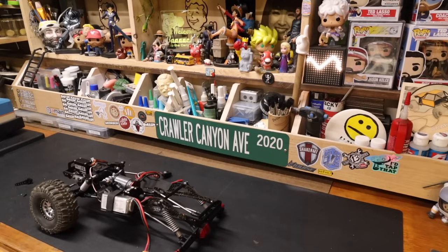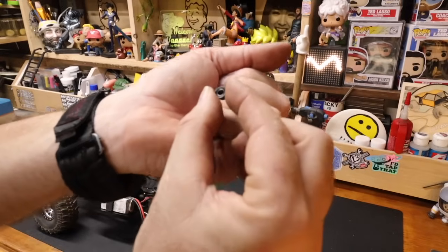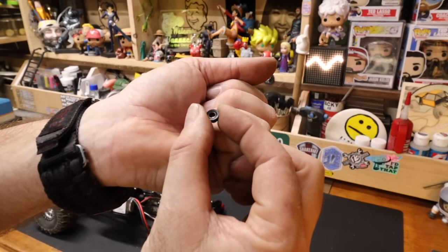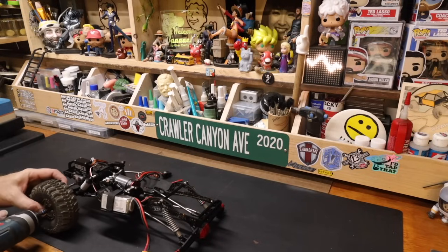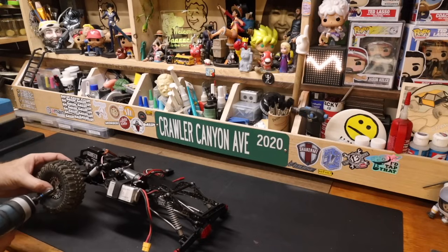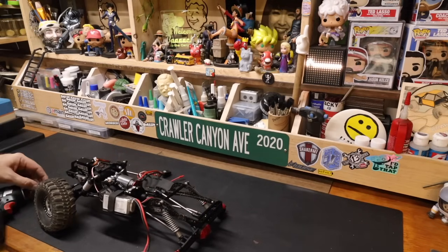What I probably don't have in the box are wheel nuts. I do not, because they do non-flanged. My recommendation to one and all is don't do non-flanged. Also, if you can, and this is great because I have it in the box to show it. Do you see how the back of that is smooth? What you want is that. Focus on the serrations, please. You want the serrated, because it will give you that last line of defense after you've reused your wheel lock nuts too many times. So instead of it falling off, the serrations might hold it on. You know, when you're distant from home and your wheel nuts fall off.